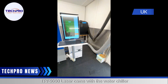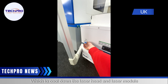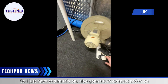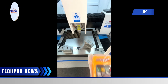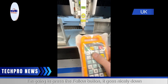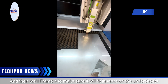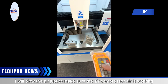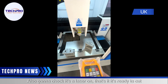The laser came with a water chiller to cool down the laser head and laser module. I turn that on, then turn extraction on, and press the follow button to bring the head down nicely. Then I frame it to make sure everything fits. I put the air on the sheet to confirm the compressed air is working, and I check that the laser is on.